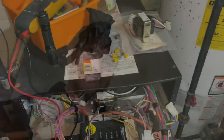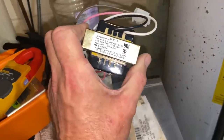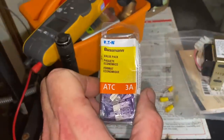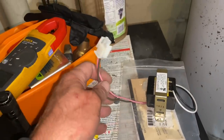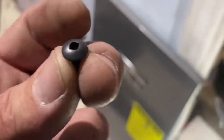Here's what we've got: a pair of gloves, a new genuine Burnham Alpine replacement transformer, some Bussmann ATC-style 3-amp fuses, and a few spade connectors — because we're going to clip the wires here to install the fuse. Let's swap out this transformer. I lost one silver screw on the floor, my long flat Phillips screwdriver isn't working well, but they include a couple of black screws in the little white case.